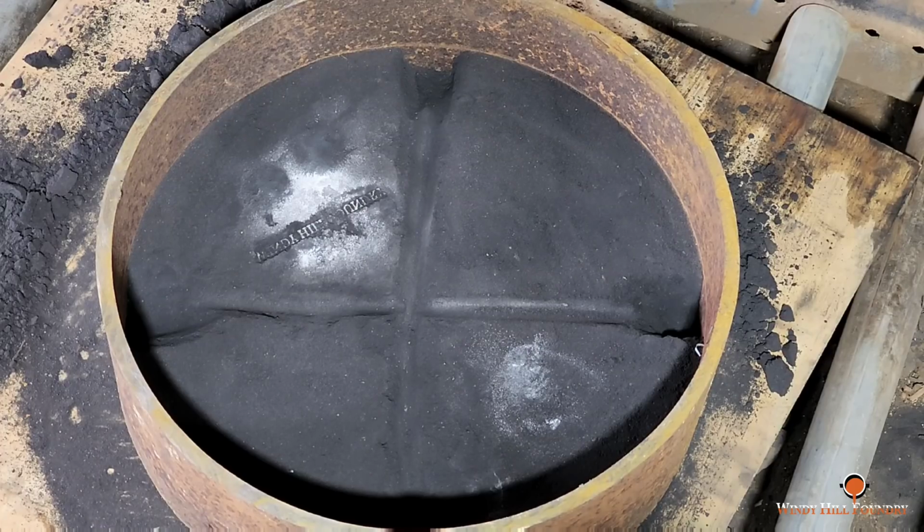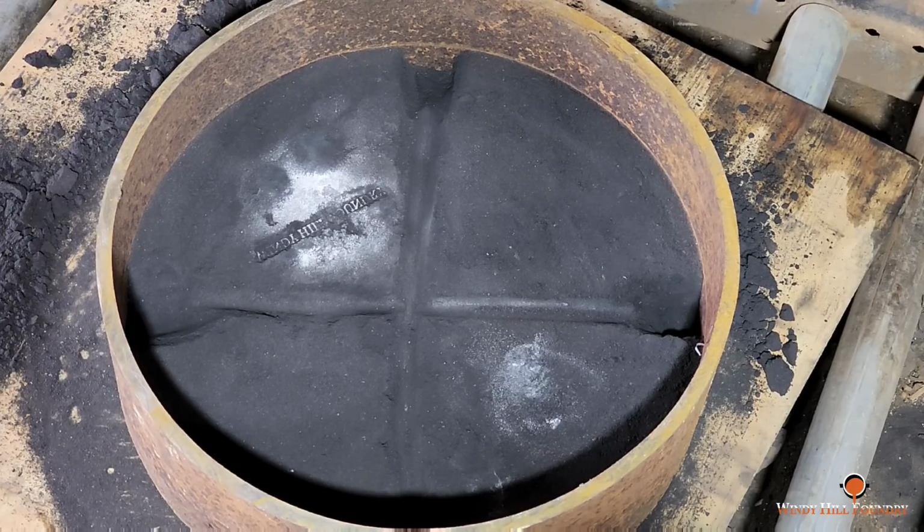Well, my friends, it looks like I'm going to be shut down a couple weeks, which I had planned to do anyway, to do maintenance, but now I've got to do major maintenance. We have most of the parts poured for our new furnace, but I'm lacking one piece, and that is this one, the bottom pan for the new furnace, which I can't pour iron in because I can't melt iron. As of last night, we had iron washed down in the burner going through all the plates. I spent most of the day chiseling half of that out. I still have the other half clogged up.